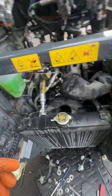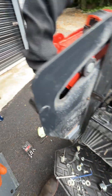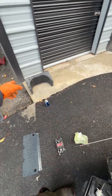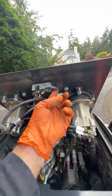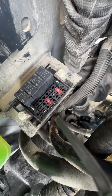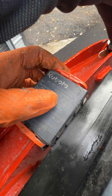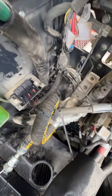So I pulled this open — don't quote me on this exactly, because I think you pull this cable here, and one of these opens the rest. Then you pull this and it opens another cover. Then you reach in and flip a lever to open this, and there's your fuse box right there. That empty slot right there is a stop solenoid 30-amp fuse — it was blown. I put another one in and it instantly blew. So I said, okay, that's going to be a fuel solenoid.